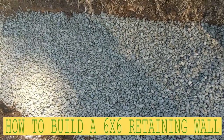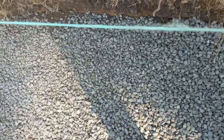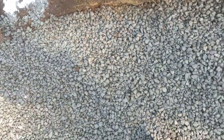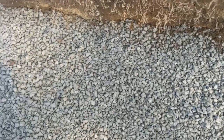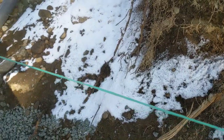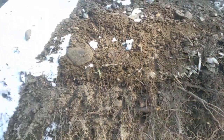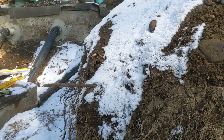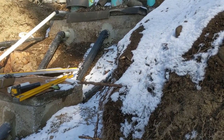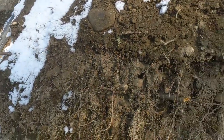Hello my friend, we built a retaining wall in here. We had the soil compacted, we have probably about 10 inches of gravel. This is gonna be a six by six retaining wall — nice and thick gravel. Then we're gonna compact it a bit more and lay down the six by six. We're gonna put a big hole behind it, that way we get all the moisture from the soil. We're gonna fill behind the retaining wall with gravel, that way there's less moisture behind it.